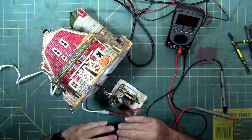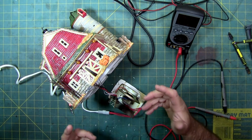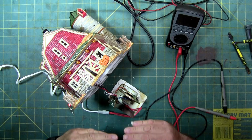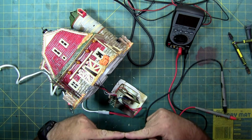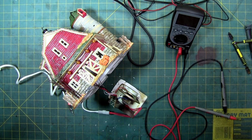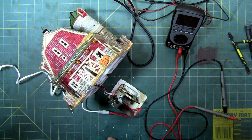Because inside, it's not that moisture gets in there, it's the circuitry is so small. It's a micro chip. No joke, literally that term micro, you need a microscope almost to see it. The little components are soldered or connected, and then when that blob cracks, there's no more connection. I've actually taken one and slowly melted the resin to look inside, and by the time we're done melting the resin, you melt through the microscopic wires too. But basically that's what happens: when it splits open, there's no more connection of electricity on certain parts of the circuit. This blob chip only controls the sound. So when it cracked, you lost your sound. Or in this case, this lost its sound.